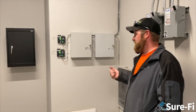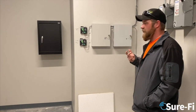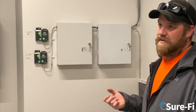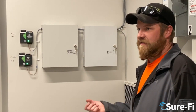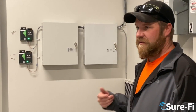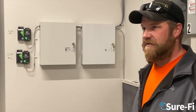Instead of running an expensive elevator control system, we only have to knock out two floors. We put it on like a door contact — when access control is initiated, it has to have a command from the access control to let the elevator car run. It runs freely from the basement and first floor, but anything after that, since the schedule shuts it off, you have to have a key card to turn the elevator on.